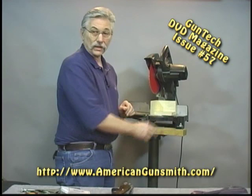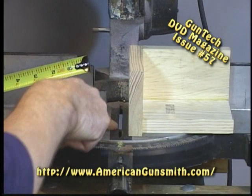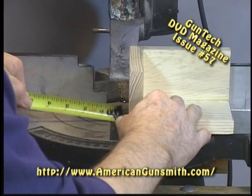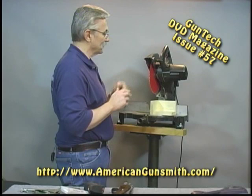The particular stock I'm going to cut — I need to take a half inch off and I happen to know that it's right there. If you don't know yet where that is, line up to where you've cut through your plate on the bottom on your chop saw. It always cuts through here, so line up to the outside of the blade and measure from this side over however you choose to do it. In this case I want it to be a half inch. Always include the width of the blade because it's going to cut it off.